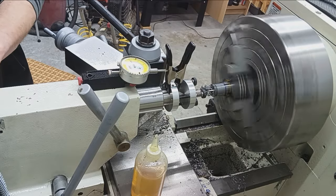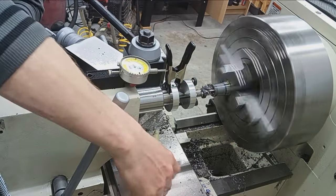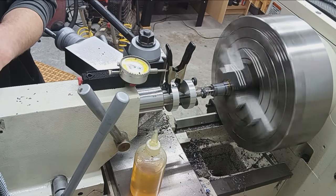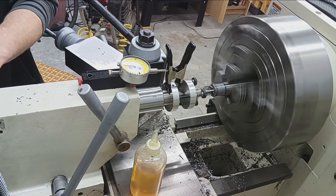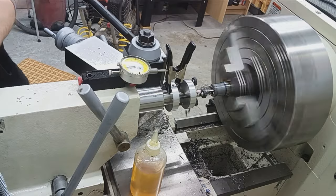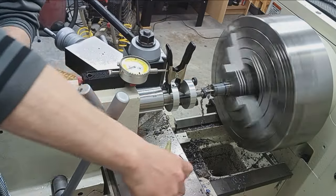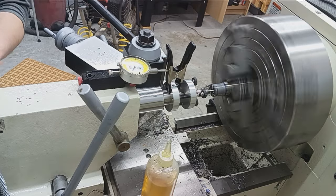So you can see the benefits of this cutter. I believe there's a few rigs that I've done on this lathe with the other method, the manual method, using the compound, cross slide and saddle. So you basically single point cut this, going into the bore, cutting out, kind of like I did on the muzzle, but that was a different gun. A lot like a recessed crown.